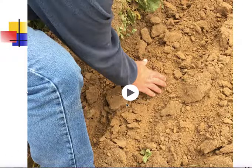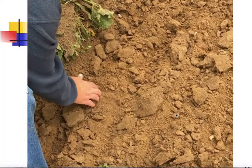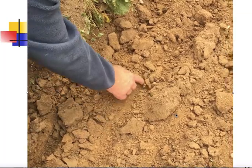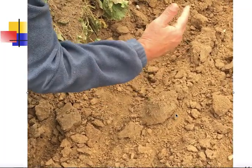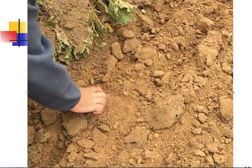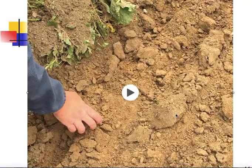Even with all the fragments, we actually do create somewhat of a hummock or hump, and we want this to go along the contour. With the downward movement of water through the sand from the coils and into the soil, once we hit the soil surface, we don't want to create an easy path for water to flow along the surface downslope. By creating these little humps, we slow the water down so it has more opportunity to be absorbed into the soil.